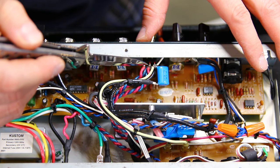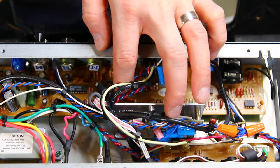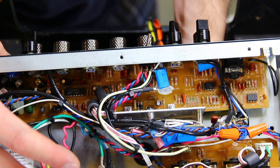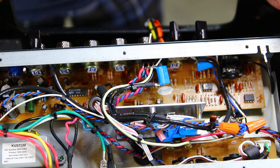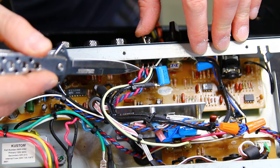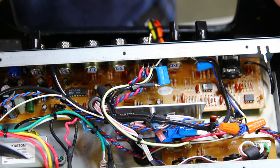And then if it's connected to this side, then this comes from these other two wires, which I believe go to the output transformer. So it's probably not the greatest design, since it looks like the tubes are being driven all the time, and if we're selected for solid state, the output transformer doesn't have a load, so not the greatest design. I probably wouldn't do that again.